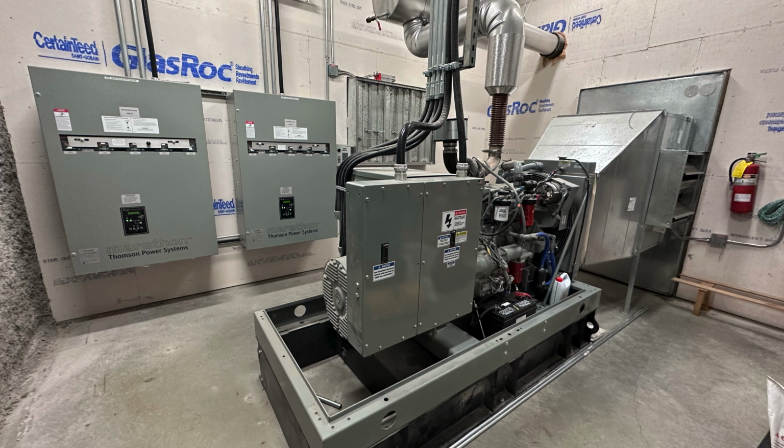One of our schools, actually, I had to flip the transfer switch too, because it was a parallel feed, two breakers. Each breaker was at, I think it was 220 amps, or maybe it was 125 amps each breaker, and we could only get to like 60 amps on the transfer switch, and then on the load bank, and then the next option over put us well over the 125 amps, so we would have blown the breaker because the next one took us to 140 amps.